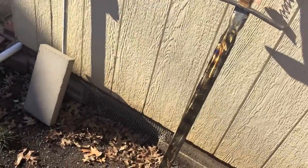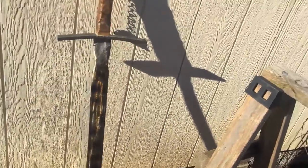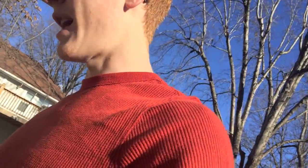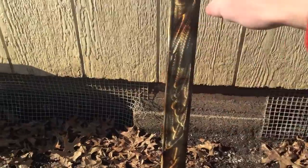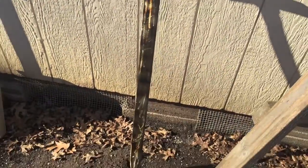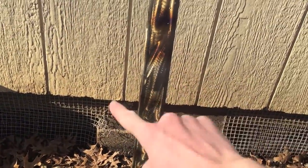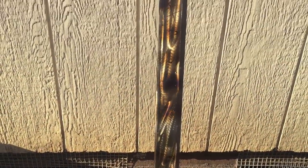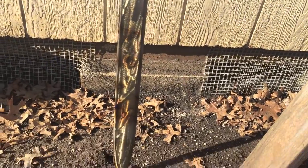The reason the blade is all gold with a little bit of purple — I took a blowtorch to it. It was actually a lot brighter in color, but I let it soak in canola oil first to keep it from rusting and second to give it a darker color, because I didn't want it to be super bright — I wanted it more natural and faded in. I think it turned out pretty nice because you still got some silver in a few spaces, and then gold and blue in between. And you can see the angle grinder marks — how it's all swirly. I thought about taking that out with the belt sander before coloring it, but I was like, that looks way too cool to mess with.